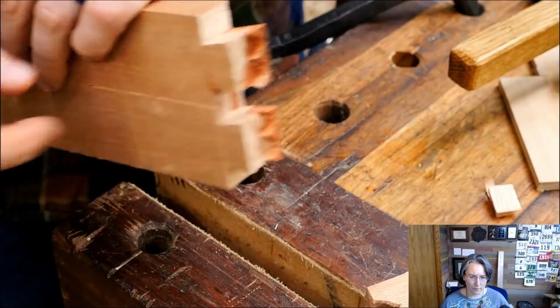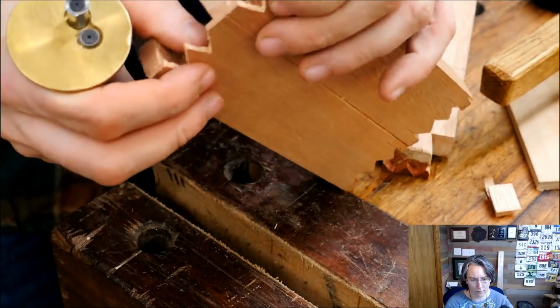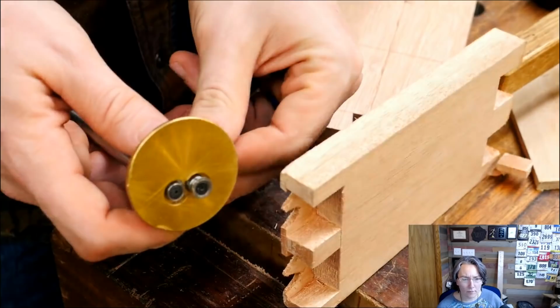Well, that shelf down, make sure I'm actually in camera here. This shelf, the distance from up here down to here, is the same as the thickness of the plate you have out here. So I can set my marking gauge up for that. That's why you can never have enough marking gauges. I usually have one for every measurement, but in this case, because I'm just doing one at a time, I can just keep changing it over. So I'm going to set it to that thickness there.